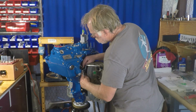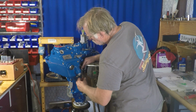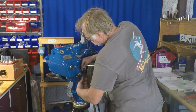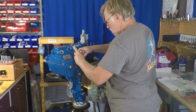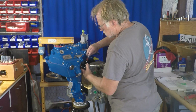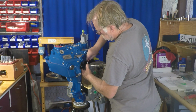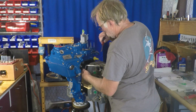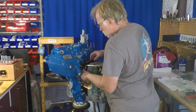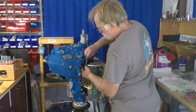Now, this is kind of important, both this and I'll talk about it a little bit more on the intake pipes, is have some pity on the next person that's maintaining this aircraft, to try to get it where they can have some access to the hose clamps once the engine is installed, because sometimes you may just have to come in after 100 hours or maybe 500 hours, 1,000 hours, whatever. And these hose clamps might need, because the rubber's compressing, just a little bit of a turn.